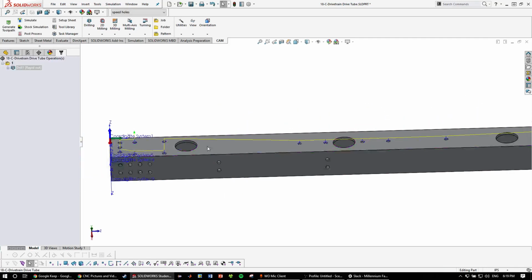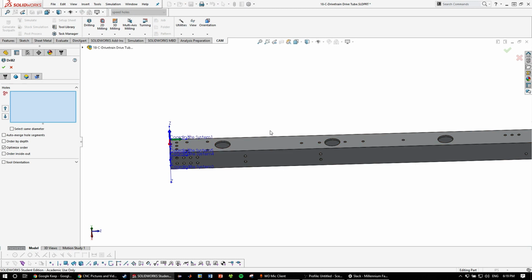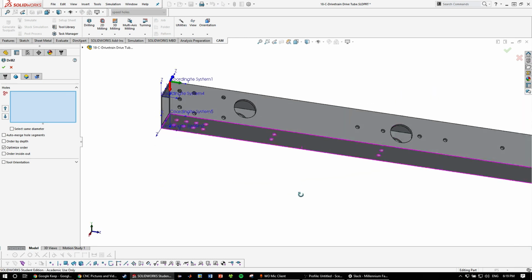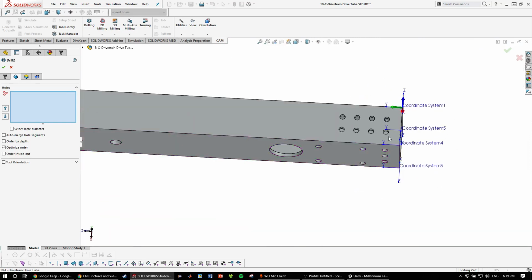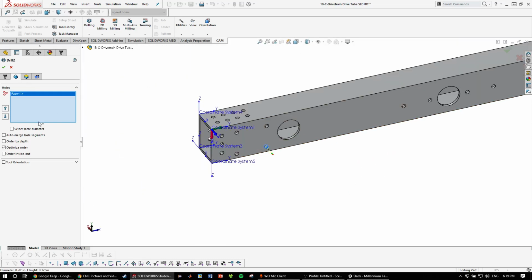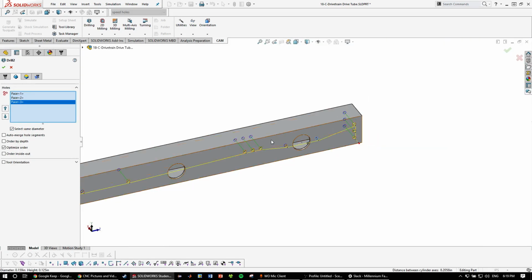And then next, we're going to want to use the 3/16 drill bit. Because flipping the tube each time, you're not going to get the exact same zero. You're going to want to use your drill bit on the holes. On certain holes, you're going to want to drill all the way through, like the holes that are through all, like these ones right here. It also saves a lot of time. So all the holes that are at least 3/16 in diameter, I believe these are all number 10 holes, so they all qualify.